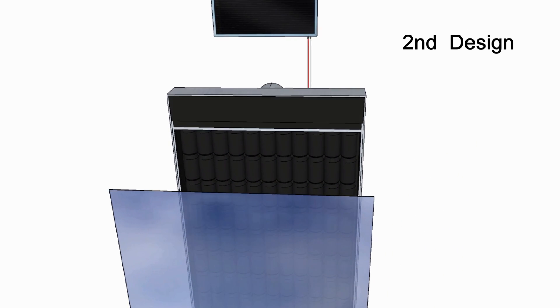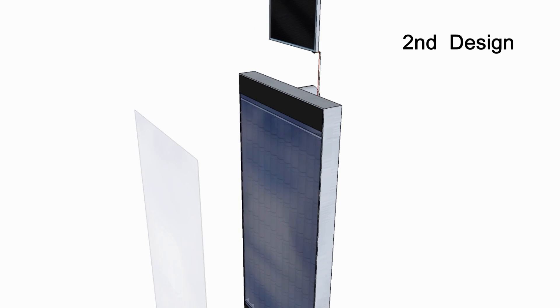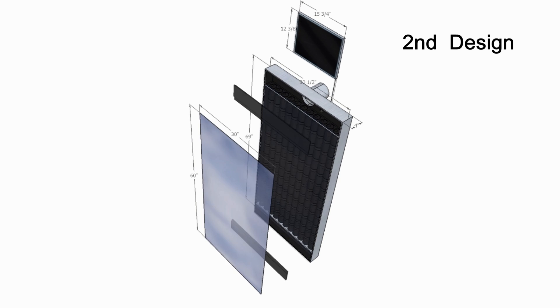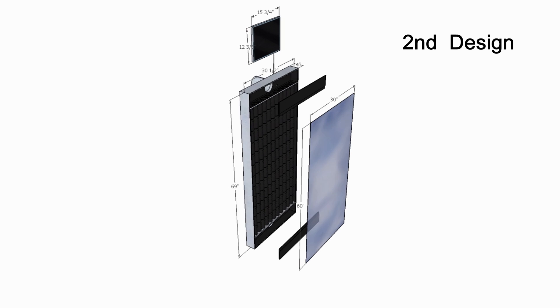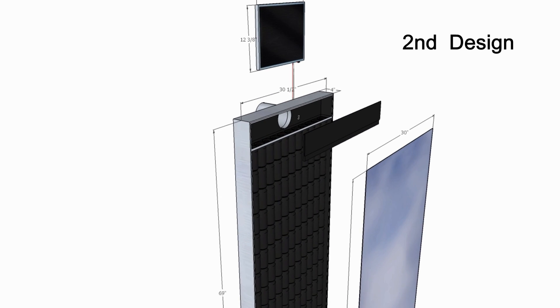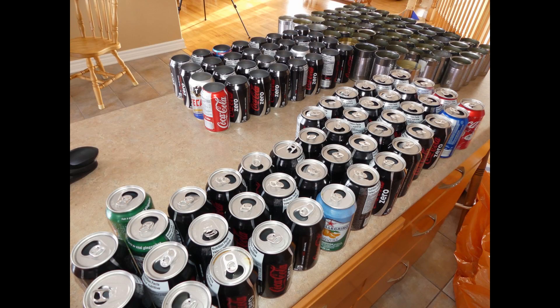The only other changes I have made to the design, not depicted here, are the addition of an override inline switch to shut the unit off during summer months, and an inline extractor fan vent backdraft shutter to prevent cold air from entering the building through the heat chamber's intake vent when the unit is not running. Enough planning — time to do some building.